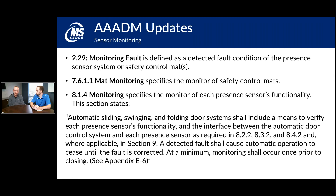If a sensor fault is detected, the door will cease operation and stand open. Some manufacturers plan to test before the door opens and again just before it closes — if a fault is detected before opening, the door stays closed; if already open, it stands open. The standard is written so that the door simply quits working if the sensor has a problem. That alerts someone that they need to call a repair technician or turn the door control off so it operates as a manual door.